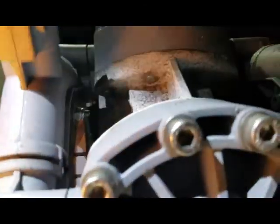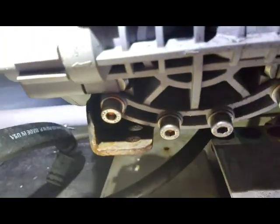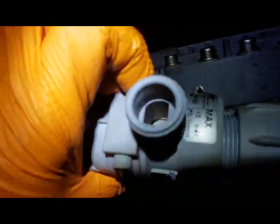I'm using Tiger Grip gloves — I love these things. They're pretty durable, hold up against chemicals, and keep your hands from getting nicked up working on this stuff. I've lost one washer — we're going to go find that and get it put on there. Then the last things to do are put the unloader on — it'll just slide in like that. I went ahead early on and checked this part by tapping it slightly and using a flathead screwdriver to pry it open. Everything looked great in there. I went ahead and flushed it since I've got everything apart.